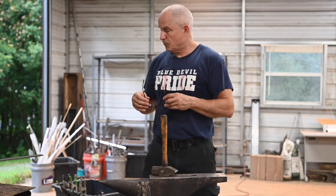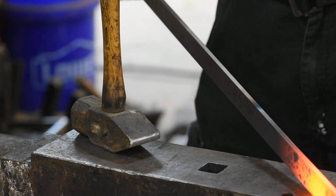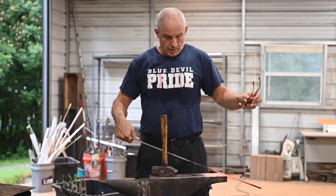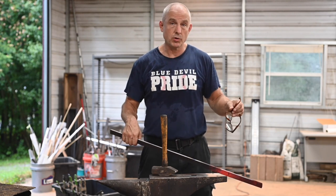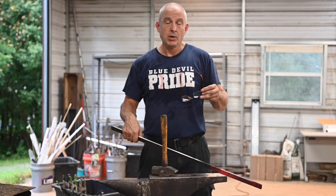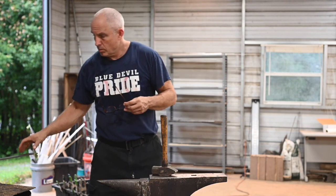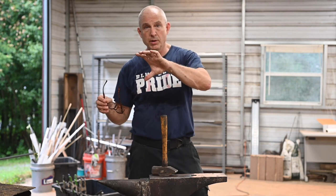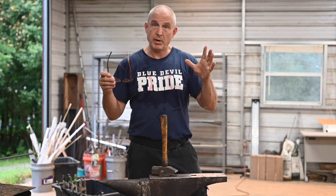What I'm going to be doing today is forging this piece of steel into a Japanese-style blade. I never say I'm making Japanese swords — I say Japanese-style blades. This is a piece of mono steel, modern high-carbon steel. I will first be doing a preliminary forging stage, and then the second stage we'll be forging it down to the actual beveled final shape. But the first stage is going to be a preform. The idea of the preform is that you want to build all your basic geometry into it, but not the bevels.